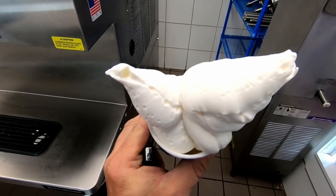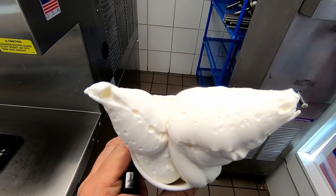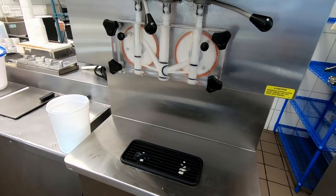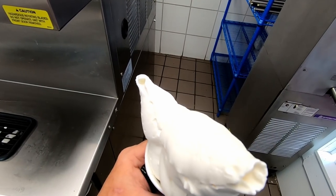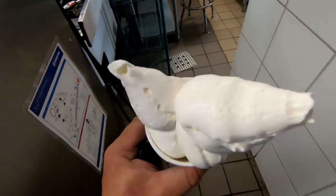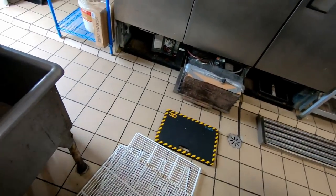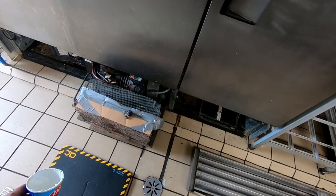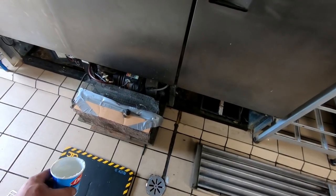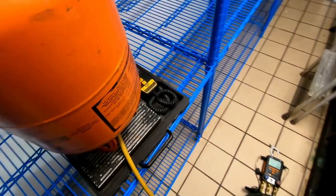You can see little air pockets there - this is way too much overrun. They may have not primed it properly, just crammed a load of air in there. It smells funny too, so I'll double-check the air pumps. Meanwhile, before I left to get the belts, I found out the freezer pressure had dropped three pounds, so we're pulling a vacuum on it. Going to charge it up - he's probably going to end up getting a new one, so I won't waste time with dryers. We need about 19 ounces in it.